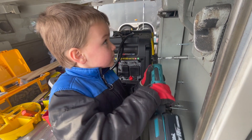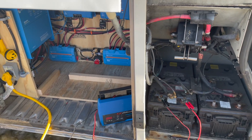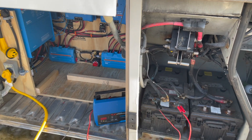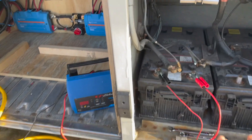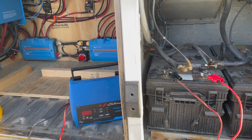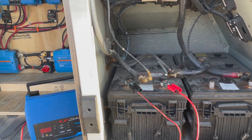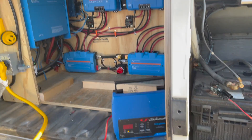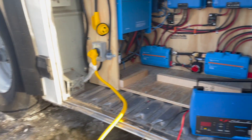Just topping off the batteries. These are two 12-volt batteries in a 24-volt system, so I had to pull the cables off and charge each battery one at a time. It was at 59% when it started last time, but it's been started a few times without really running much. I'll charge this battery up and then charge this one up tonight, and in the morning we're going to fire it up and try to back it out of here.